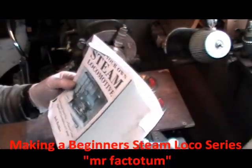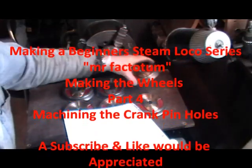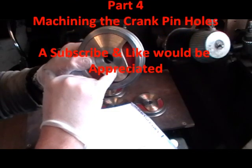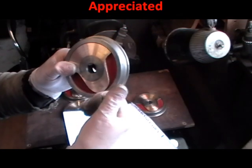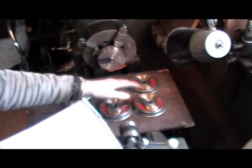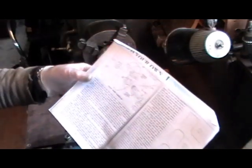Moving on now to the last operation on my wheels. I'll just do a little explanation before I move on. On my finished wheels I've got to put a crank - a hole for the crank pin to fit - one inch from the centre on a one inch radius. It's got to be half inch reamed, the diameter of the hole, straight through, and it's got to be the same on every wheel. We'll do it how the book's telling us, because there are many different methods you could use for getting holes at a one inch offset in exactly the same position on each wheel.